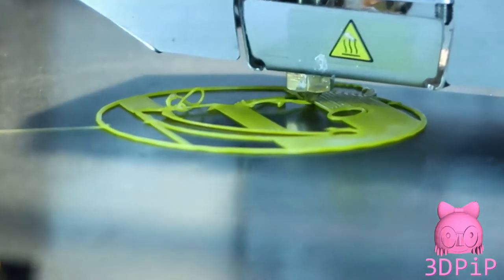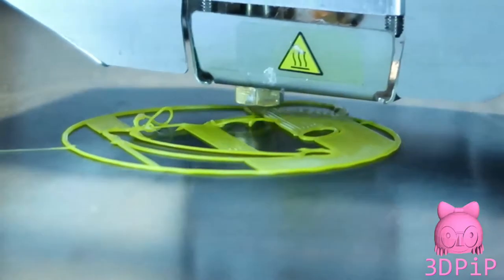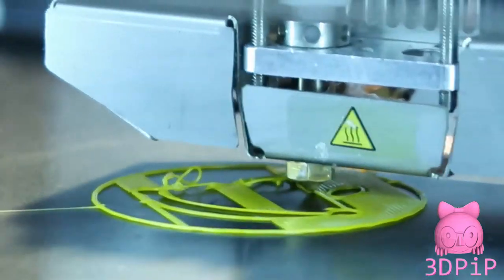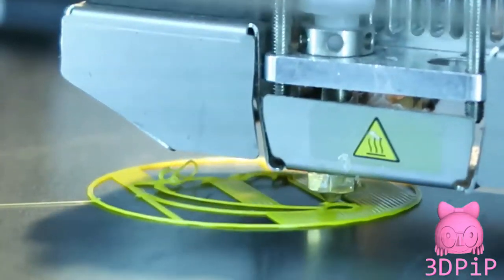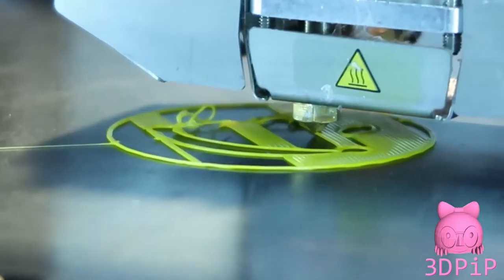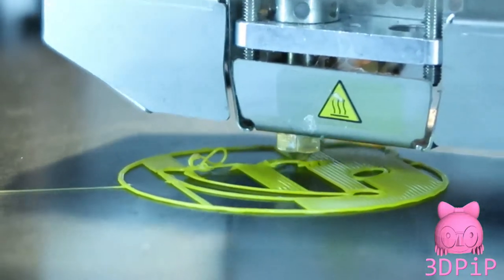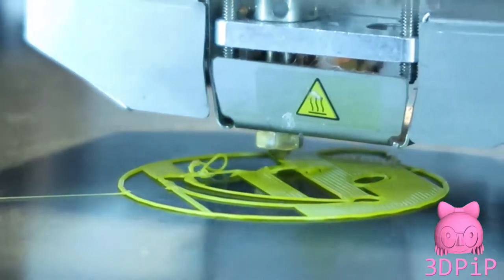And when I got the printer at first, I had so much trouble with the glass plates. It just kept coming off the plates, and I'd do like 3 or 4 layers, and it'd come off the plate. It was too slippy. Basically what it's holding onto is some prayer and a bit of glue stick. And the glue stick is actually there to just make the surface rough. It doesn't actually glue anything.